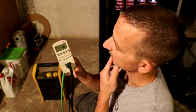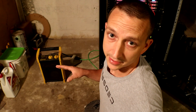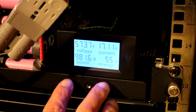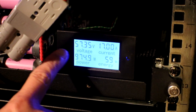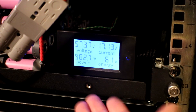I might want to bring that up a little bit but I'm just gonna start the test with this and see how it goes. It's getting a little chilly down here so this will be a nice welcome. The multi-function meter shows roughly 980 watts — it jumps up and down — we're pulling roughly 17 amps and our voltage is 57.37, though this meter reads a little high, probably around 56.8 or so.